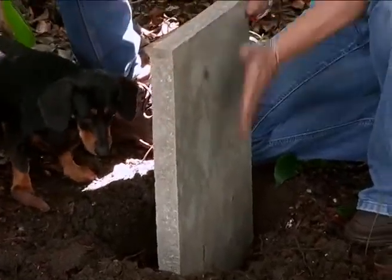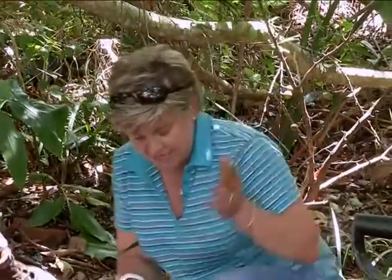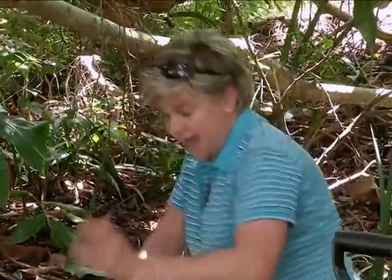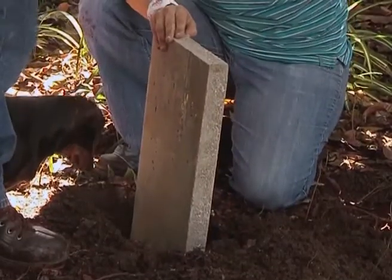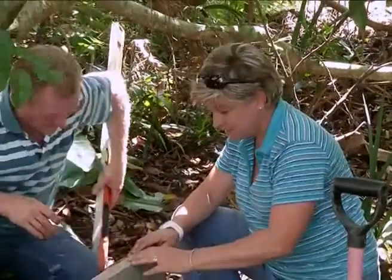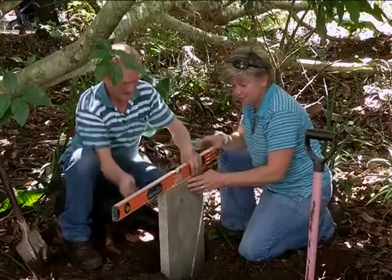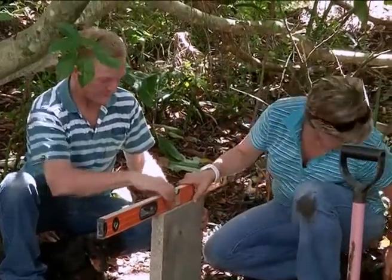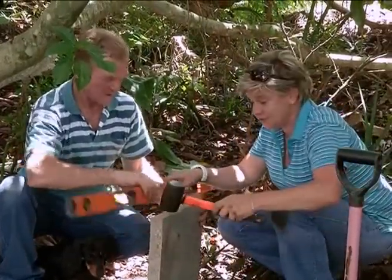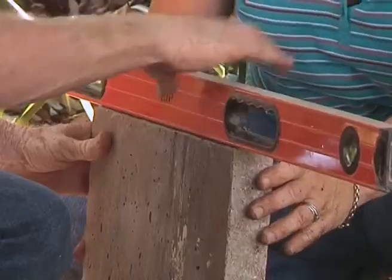We place the leg in the middle of the hole. The first one is not critical in terms of your spacing — if you measured correctly and dug correctly, the middle of the hole should be just perfect. At this point we want the spirit level because we need to make sure that this is level. If your groundwork is not level then you're gonna have a problem. Let's put some soil underneath here, make sure it's nice and level, give it a bit of a tap — that secures it well into the ground below.